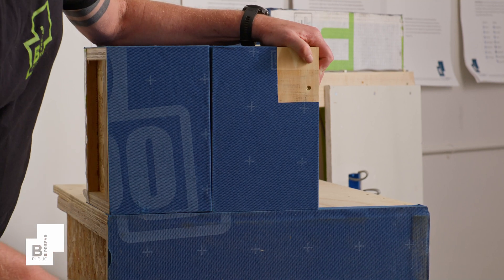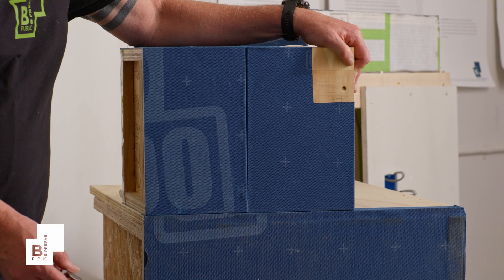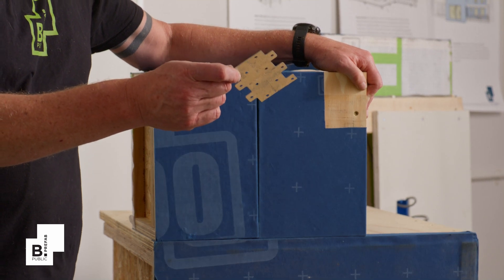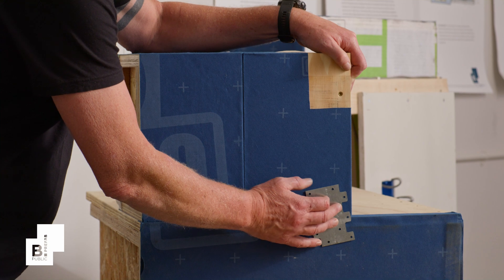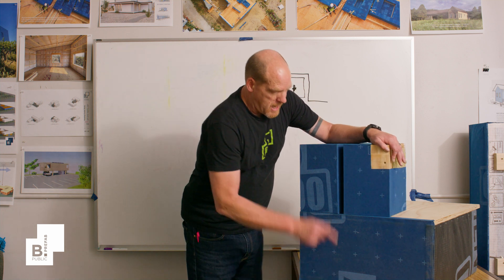When those pieces come together, they can be connected and form a really nice tight joint without any thermal bridging in that section. Typically for structural connections, Simpson LTP4 ties are used to create the individual connections between the panels. The spacing is set by the structural engineer depending on the specific shear loads based on either wind or seismic. It's a very straightforward system. We've done a lot of testing and analysis of those joints as they come together, and there's zero thermal bridging there.